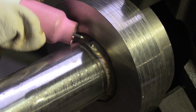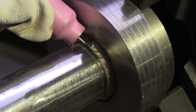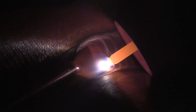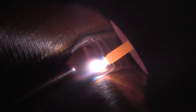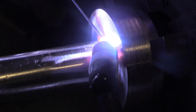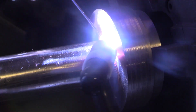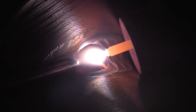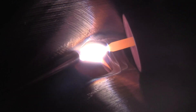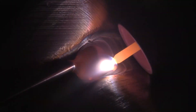That's going to look something like this. You could argue this is wiggling the cup for these first few passes — you've got it resting against the side walls and you're really just rocking the torch back and forth. It's actually a little bit easier than technically walking the cup out on a flat surface where you're doing sort of a figure eight. It's a lot like walking a drum across a shop floor.